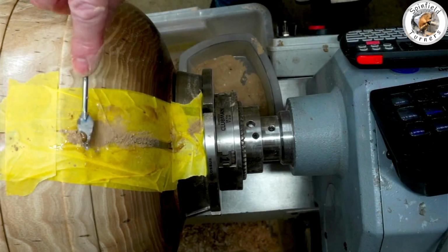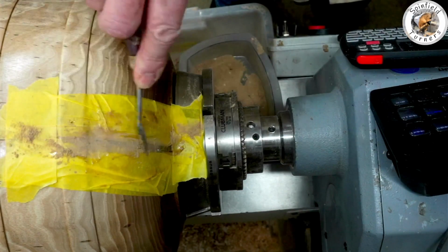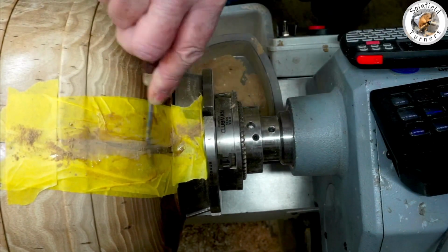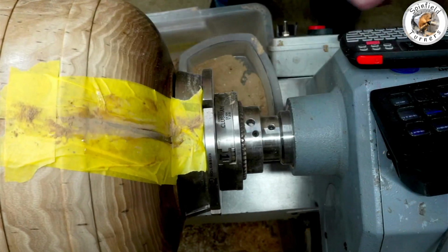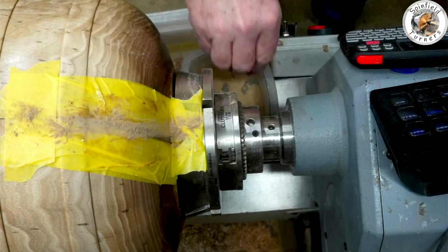And then I experimented whilst the epoxy was still soft, but as it was stiffening I've filled the surface of the epoxy with some more wood dust so that when it's abraded it's got a slightly more woody finish.